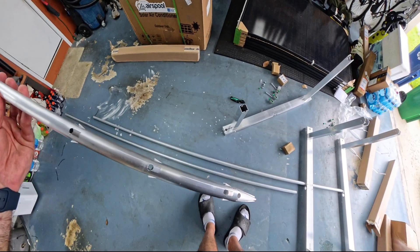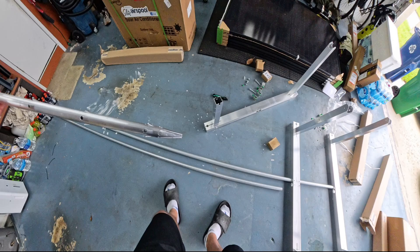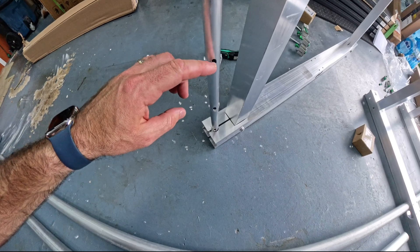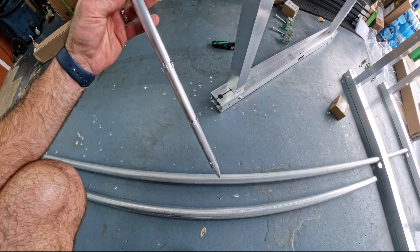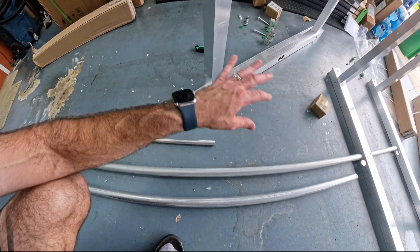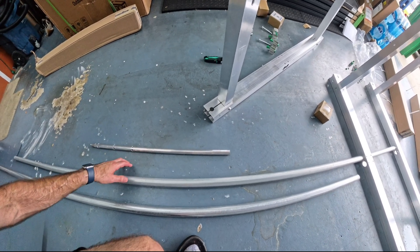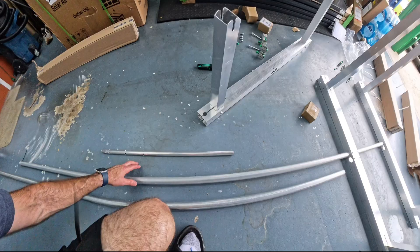Here's a closer look at one of the spikes from the Integra Rack spike kit. It has barbs and the whole thing is hollow — the spikes go into the ground and you fill them with the included epoxy, which leaks out the openings and forms what I've heard called 'epoxy roots,' providing quite a bit of uplift force. That means I don't have to sink this into a concrete pad, though that's another option. Ballast mounting with dirt, parking blocks, or anything heavy is also applicable.